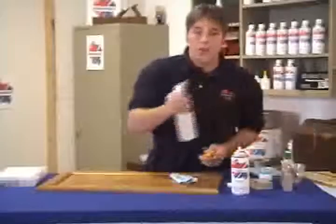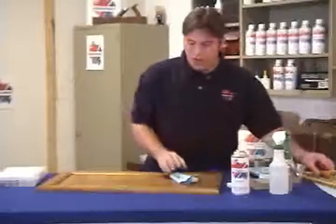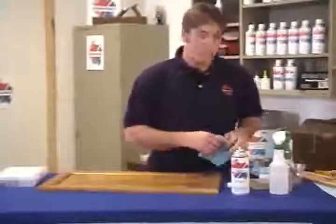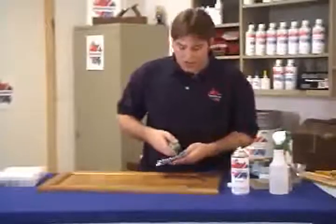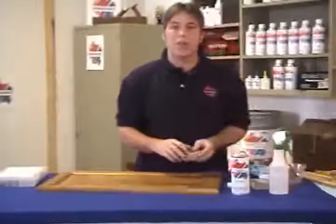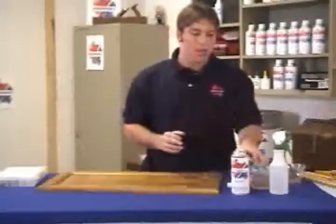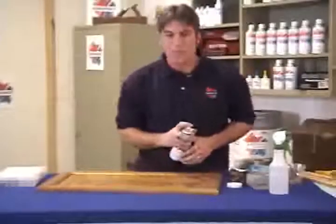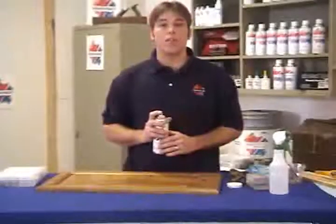Now we need to cool the burn-in again. Remove the water with your paper towel. And to remove the burn-in balm, we need a little bit of mineral spirits on a rag. With my sanding sponge, I go across the surface once or twice. And then I top coat with aerosol. And that void is successfully filled.